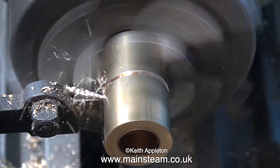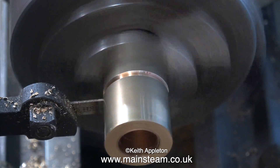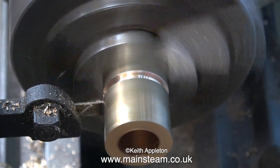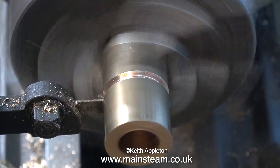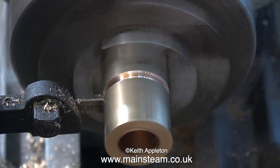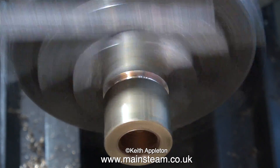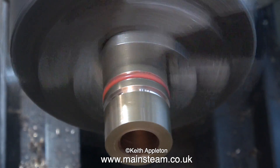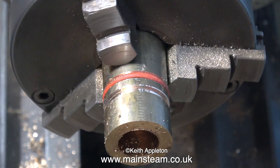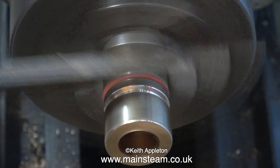The next part of the job is to use a parting tool to make a groove to take the O-rings. I'm going to put two grooves in for two O-rings. At the moment I'm using a parting tool that's a bit thin, mainly because I can't find my other one — maybe it's in the box of bits I've just taken over to my new workshop. The thin parting tool will be fine for this job; I just need to take multiple cuts. After finishing the first groove, I'm using a file to remove the sharp edges so it doesn't cut the O-ring. I fitted the first O-ring somewhat prematurely, so now I've machined the other groove and I'm removing the sharp edges from that as well.